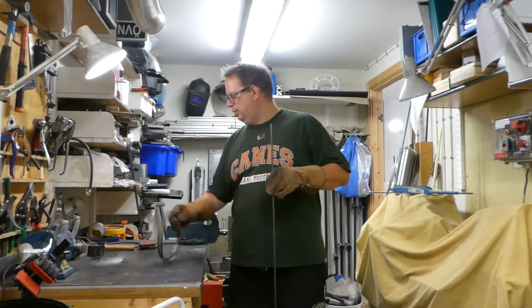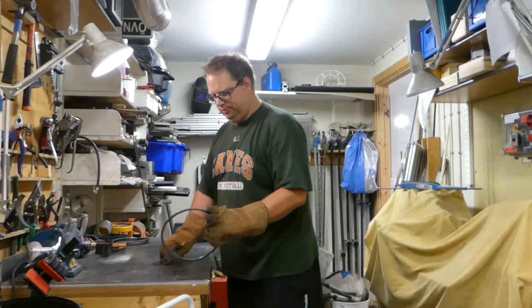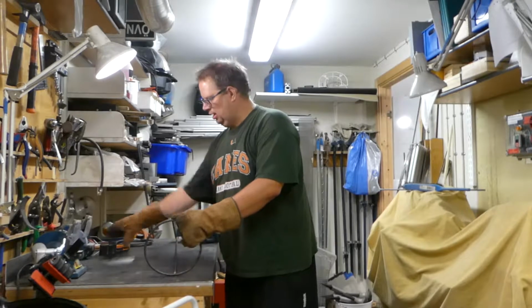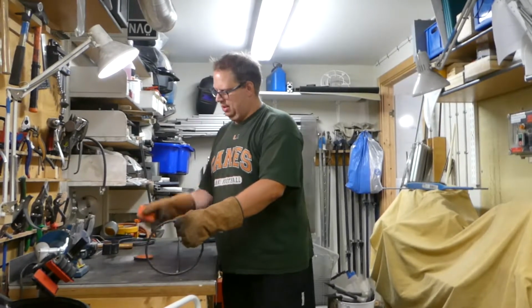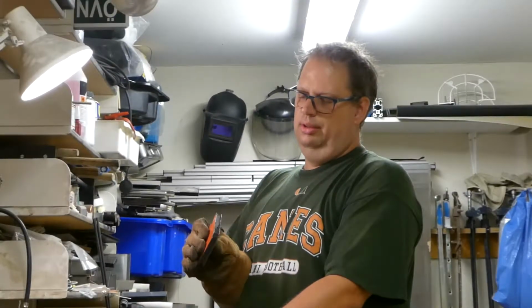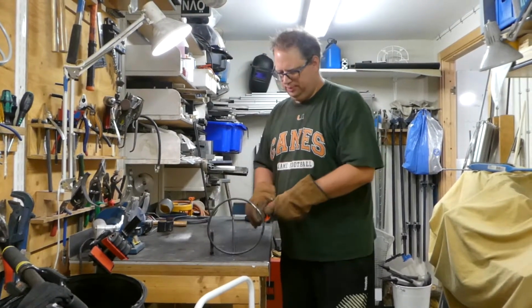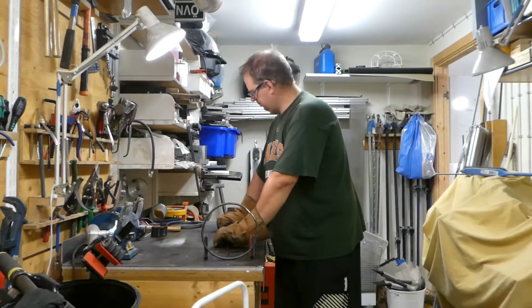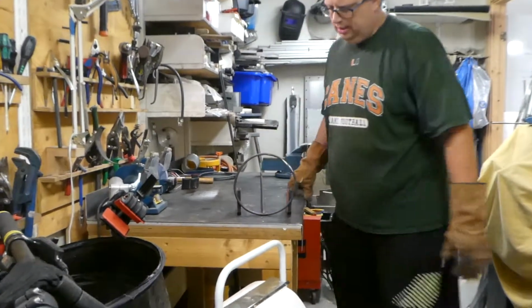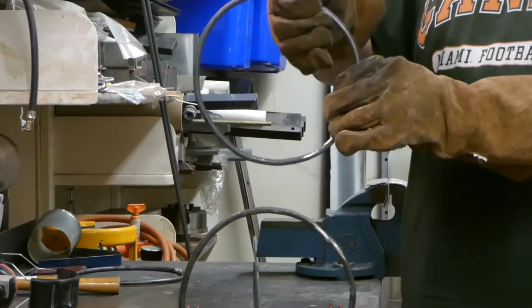My welding table is a little bit too small for this kind of work, but let's see what we can do. And then this one, I've seen them all over the world more or less. It's just 90-degree magnets. The benefit is they're very easy to use and you can hold your things in place. The drawback is they collect all small metal pieces, and it's quite hard to clean them up as well. So let's see if we can put that in 90 degrees. And we also need to put, let's see if it's this one, in 90 degrees.